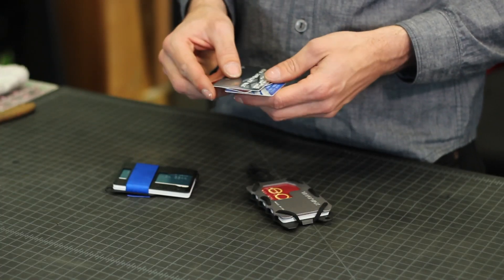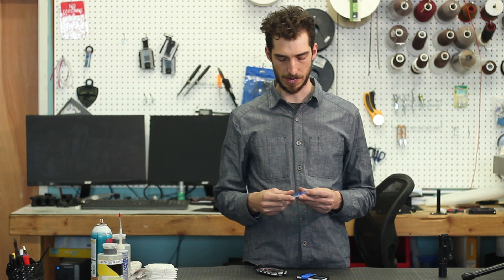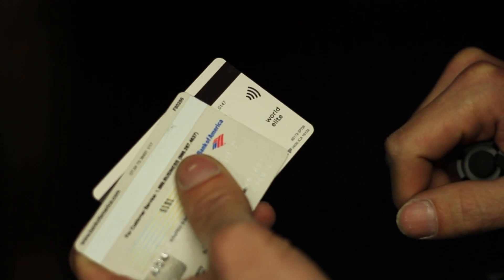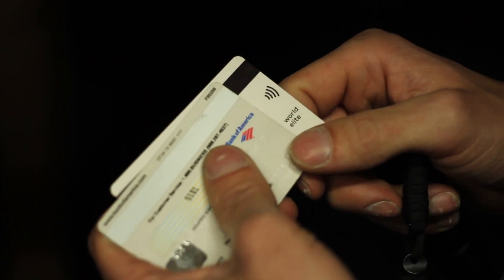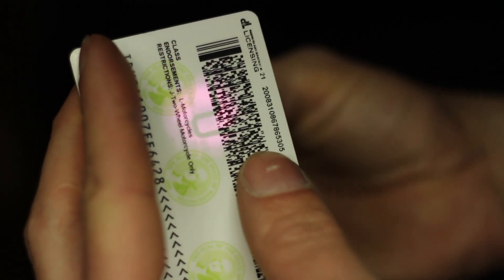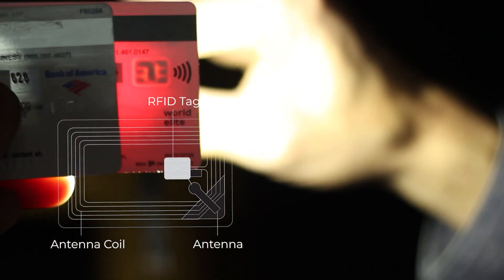There are a few different technologies out there, and we're going to show you a way so you can see which types are used in your cards. The main types are chip and pin, RFID, and NFC. These cards here have a chip on them, and that's often confused for being an RFID chip, but these are actually chip and pin cards and do not have an antenna in them. The easiest way to tell if a card is RFID or NFC compatible is if it has this little radio wave symbol on it. You can see if there's an antenna in your card simply by going in a dark space and using a bright flashlight to shine through the back of the card — you'll be able to see the antenna that surrounds the edge of the card.